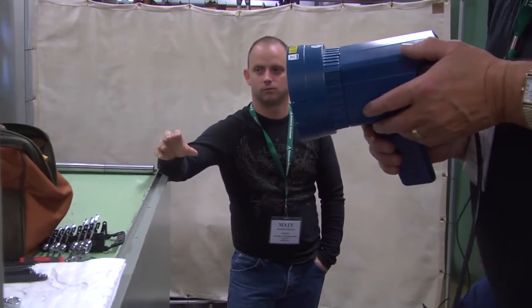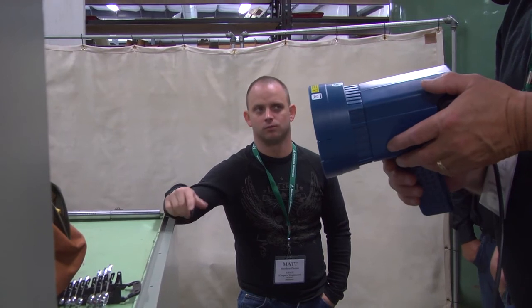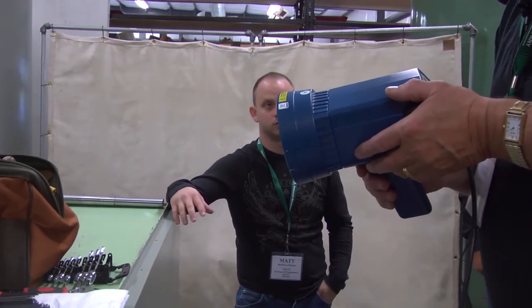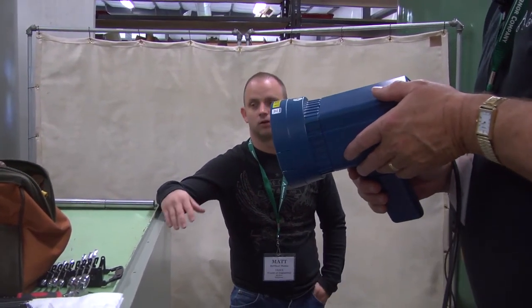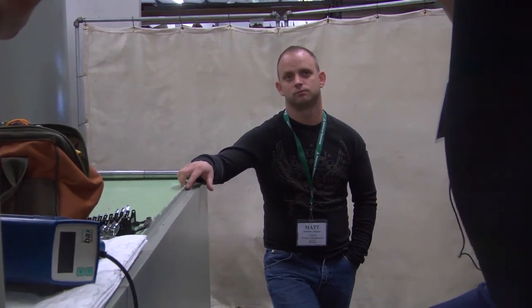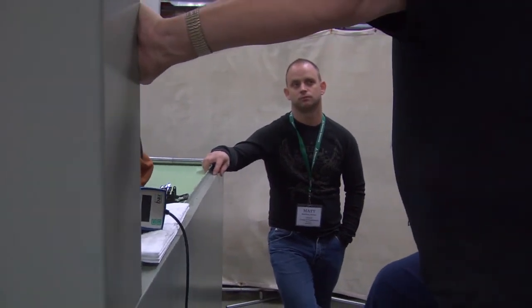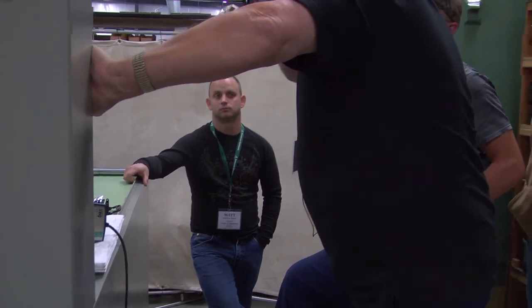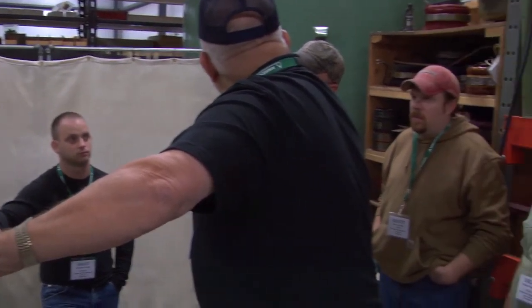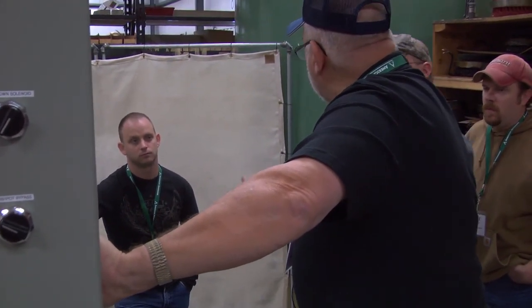When it's just sitting, not speeding, the ball head is not moving at all. In fact, you'll find on a Pelton ball head, when it first rolls off and you can see the unit start to move, it'll be a little behind the shaft until it gets up with enough juice, because the PMG is just building voltage and can't turn it until it gets up to a certain speed. It's usually like a 4-to-1 difference anyway. This spins a lot faster, whether it's a 4-pole, 6-pole, 8-pole, or 12-pole.